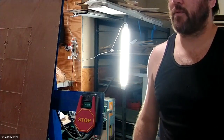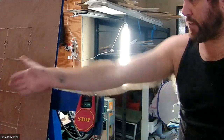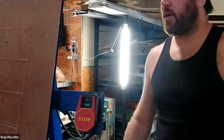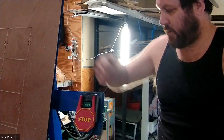I've broken one, and they're cheap on Amazon. I mounted this one too far forward, so the sled's coming over and I need to mount it a little farther back. When I come all the way over, the sled hits this, and that's what your router's plugged into. That's what the controller is. With the first one, if you killed it, you'd have to recalibrate. With this one, you shouldn't have to recalibrate on version 2.